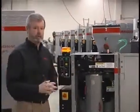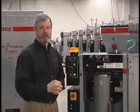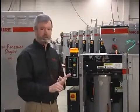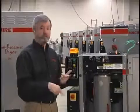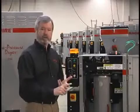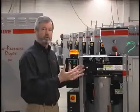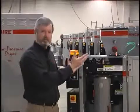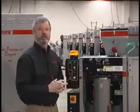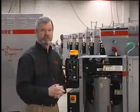Finally, I'd like to talk a little bit about price. Typically, a vacuum dryer is priced about the same as a desiccant dryer. We have the benefit of the savings of, number one, no desiccant beds, no regeneration circuit, so we save a lot of money with regard to that, and we don't have a drying hopper. The canister is actually the drying hopper. So unlike a desiccant dryer, where you have to have a very large drying hopper that can hold 4 hours worth of material, we've eliminated the size and the expense of that drying hopper, and that allows us to keep our price competitive.